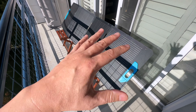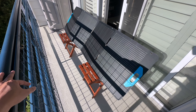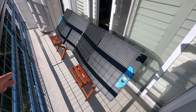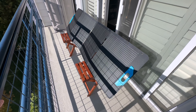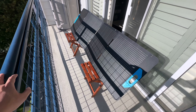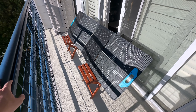In this kind of situation I get about 50 to 100 watts depending on the sun, since there is always some partial shading — so that's something to be aware of. But in general it's a good panel. I also like that they've added micro inverters into this panel, which makes it operate more efficiently when there is some shade. That's something built into the new Anker solar panels.